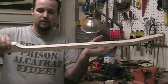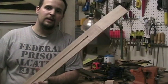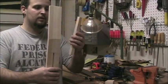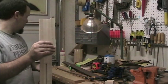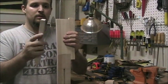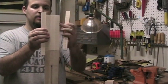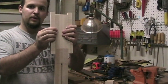I took part of the chunk I cut out and lined it up and sawed off a couple of wings. All you do to put these on is bring them over, line them up so the grain orientation is the same, and add one to either side — just like that. Then you go ahead and glue them on — put glue on both sides, both faces, smear it out, put them together, and hit them with a couple of bar clamps.